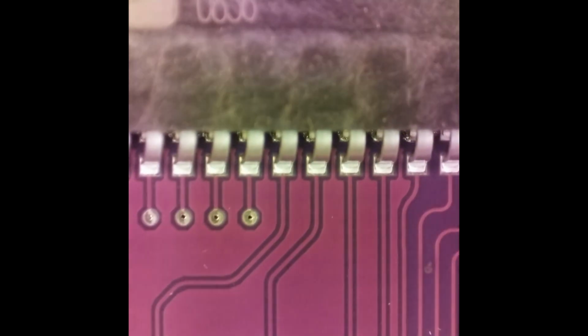So it looks like we got a lot of solder balls. So that's probably because my solder paste is getting old and doesn't have enough flux in it. But we'll just have to deal with that for right now. I don't think it's a big concern because it's stuck on there with the flux from the solder paste. Maybe we could have held it a little more longer dwell time when we soldered. I'm not too happy with that. I don't think it's going to cause any problem for right now, so I'm just going to let it ride and see what happens. We'll have to verify that the pins are soldered down, and I believe they are. It's just I probably got a little too much solder paste on.